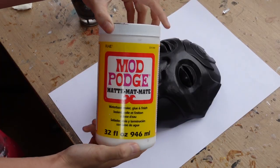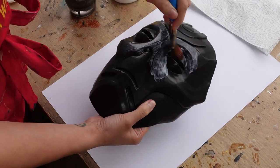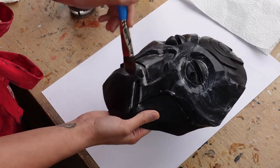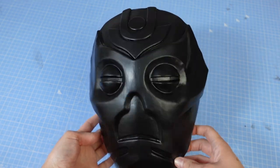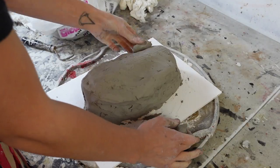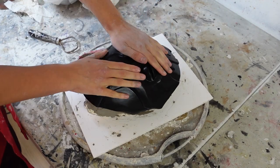When I was happy I used a bunch of layers of Mod Podge to seal the mask properly. This gave it a smooth hard coating over its surface which was important as I knew I would be moulding it in silicone. Next I could begin prepping to mould the mask. I started by placing the mask onto a face cast I had sculpted over to create a base for it to sit on.